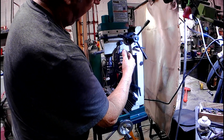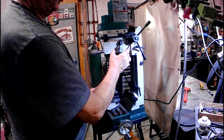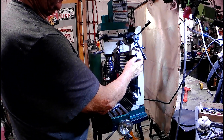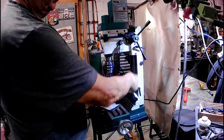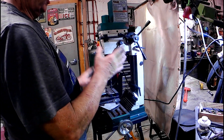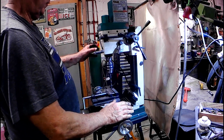Once you put it together you can't easily grease the gears. So what I did is — there's a seam right here — I laid a piece of tinfoil in there when I bolted it together and siliconed it, and I filled this cavity with grease. The tinfoil keeps the grease from migrating back into this hollow section. So this is all greased and that should last a lifetime. It's two-speed and everything works.